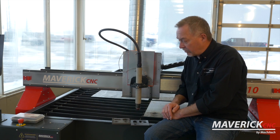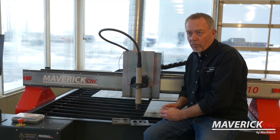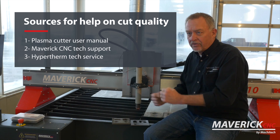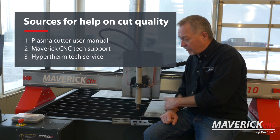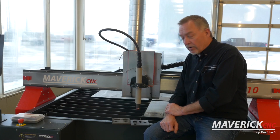There are a few little tips like that, and some good sources to get help. Go to the machine manufacturer's service group and say, 'I'm getting ugly cuts, what do I do?' Or go to Hypertherm, the manufacturer of the plasma — the tech service department there can also help you fine-tune cut quality. Maybe before you do that, open up the manual, because there are pages in the operator's manual with pictures of typical cut quality issues and the easy fix. Sometimes the opposite of what you think will solve the problem. Any questions, we're more than happy to work with you and help you out. Thank you.